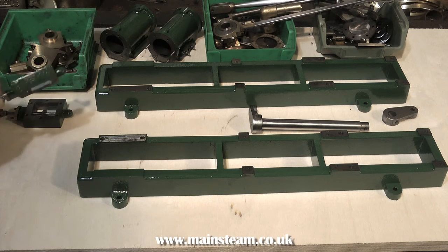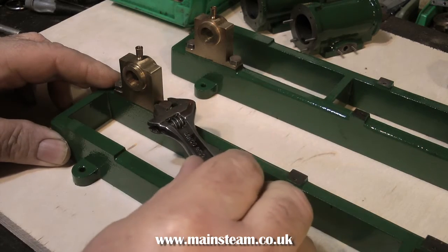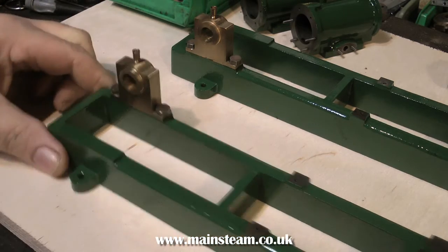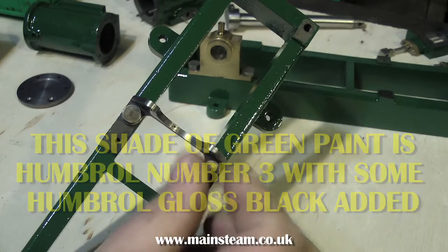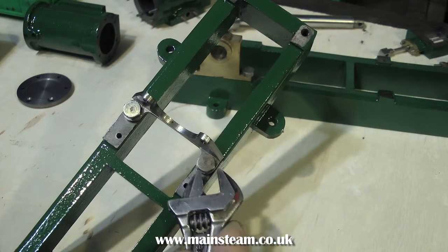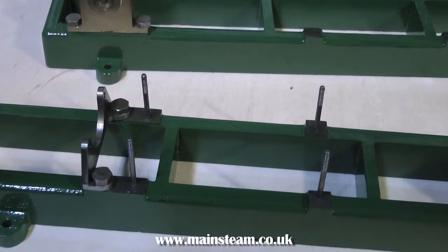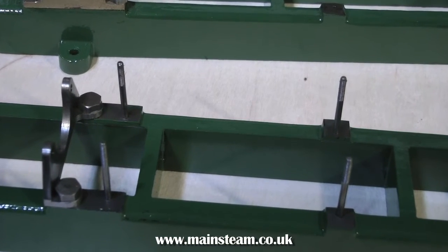What I would normally do is give the engine a first coat of paint, and this is the first coat that you see here. This green is not Stuart green — I don't actually like the modern Stuart green colour, so what I do is mix my own. This is Humbrol number 3 green with some black added, and the more black that you add, the darker the green gets. I generally do not paint all of the parts. These are the cylinder brackets that hold the cylinders in place, and I don't like them painted — I think they look okay in a natural steel colour. A lot of full-size mill engines that I've seen are generally painted green, but they do have a lot of bare metal showing. Yes, it will go rusty, but a bit of oil generally takes care of that. It's not a problem in the model.